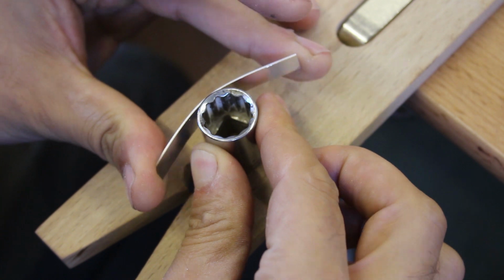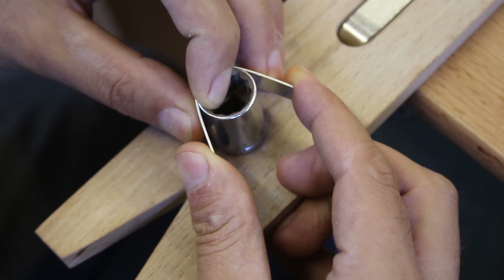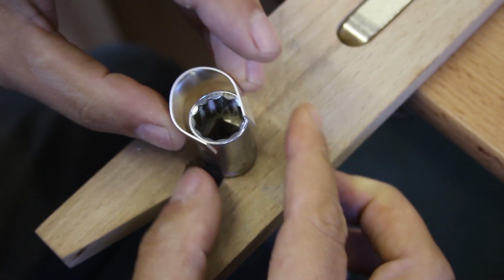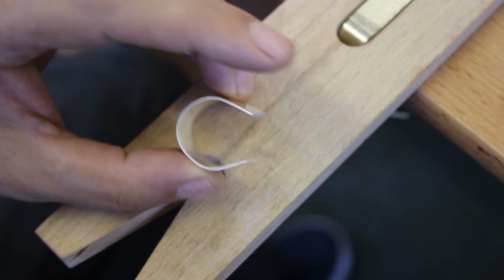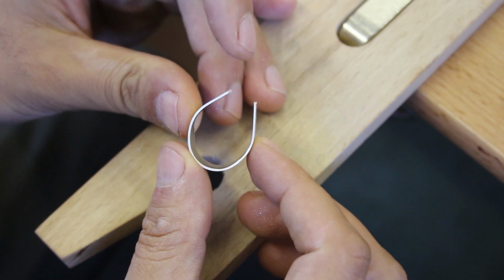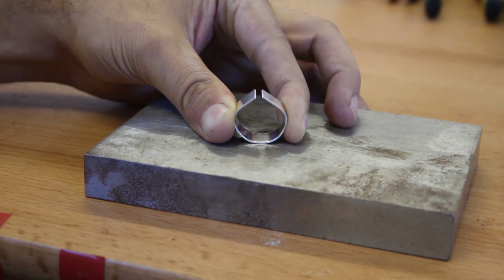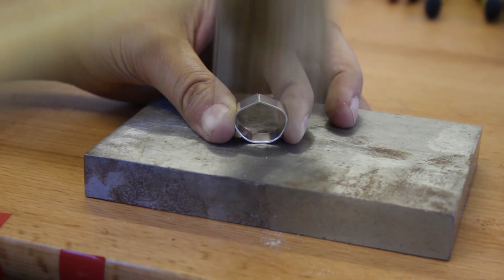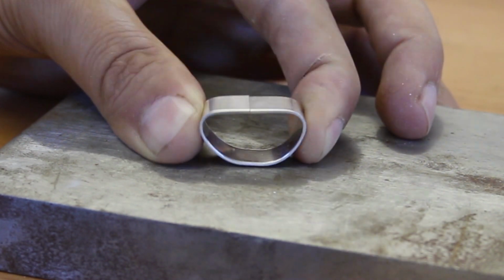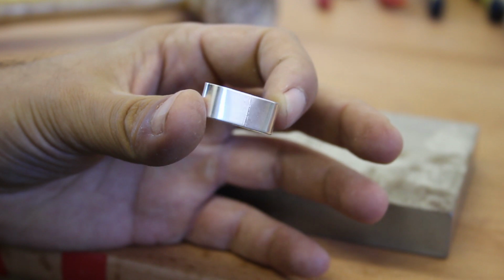But anyway, after I cut the piece of silver, it was time to use my enormous crushing strength to bend that piece of metal so that the edges were nearly touching. At that stage, it formed a kind of Millennium Falcon sort of U shape, and so I used a rawhide hammer to hammer the edges down into a D shape so that they were meeting up flat with each other, ready to solder.